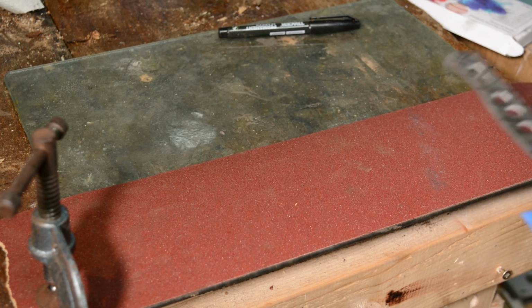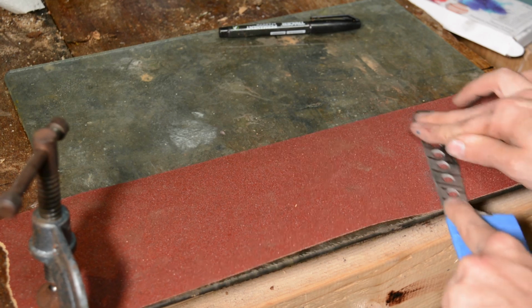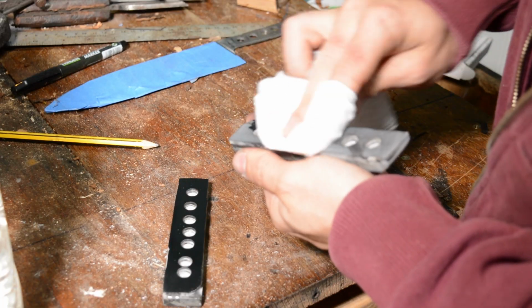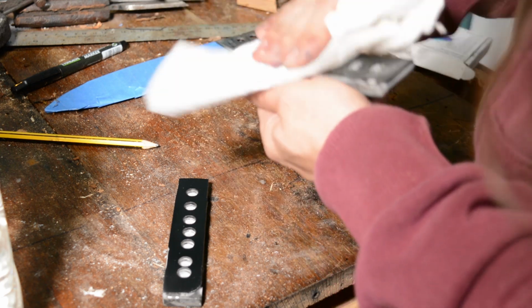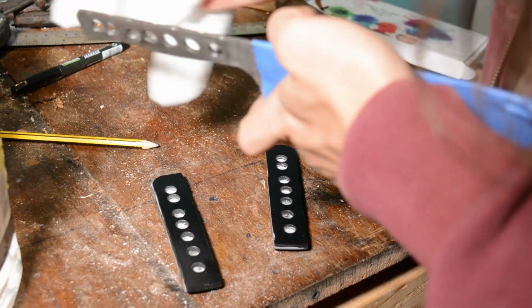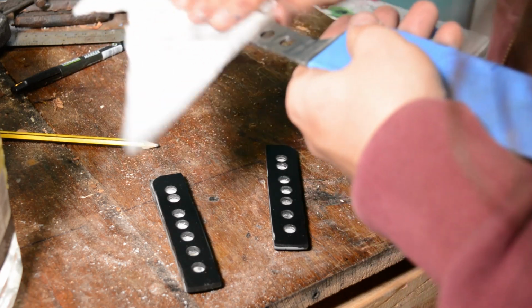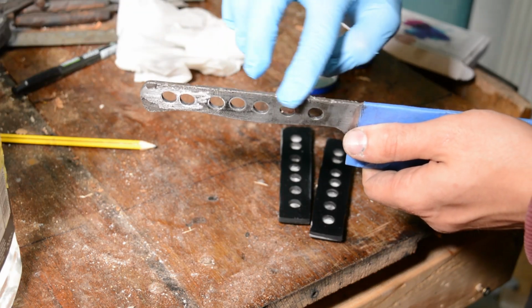And I've done quite a lot of these. I've never had any problems with it. I'm quite confident in it, but you really have to get as much glue in there as possible, and the surfaces really need to be tight. More important than the glue itself, because people argue all the time about G-Flex or BSI or 5-minute epoxy, I don't think there's a massive amount of difference functionally between them. But the most important thing that you can do to make sure that your glue works is clean the surfaces.